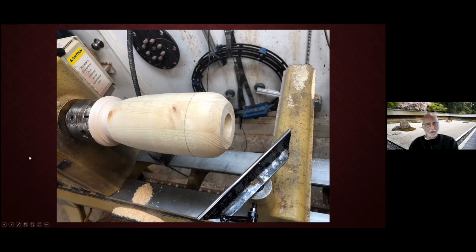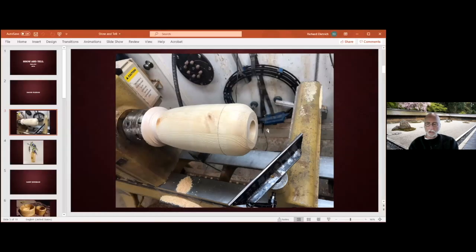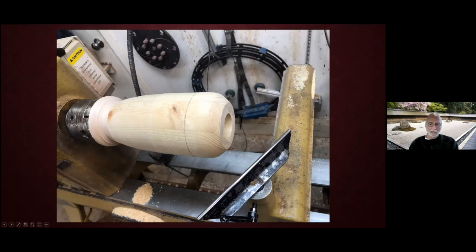This is made from some pine shelving, 4/4, which means nominally under 3/4 of an inch. And by the time I made it flat, probably closer to 5/8 of an inch. And so the first step was laminating two together so I could get a decent thickness. And then essentially what you do is you build a box, a rectangular box. The hole later gets filled with a glass insert that I bought from Amazon.